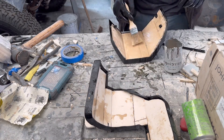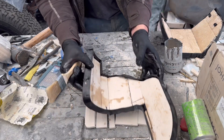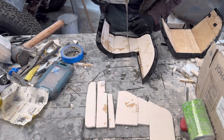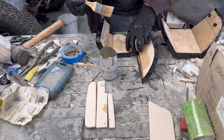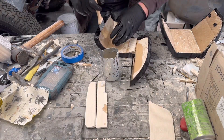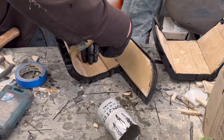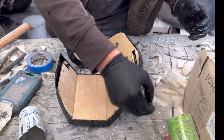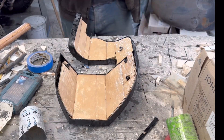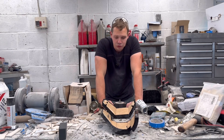It also helps that because this pauldron design is bigger, you have more overlap on each piece, so I don't have to be perfect in getting it to line up at the edges of the print. All of this ceramic will be covered over by a stainless steel backing plate — kind of similar thickness to medieval armour, it turns out. And there'll probably be a composite layer behind that which will also hold nut inserts so it can be attached to the exoskeleton. And that is the ceramics laid into the new upper arm and pauldron design.